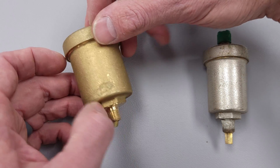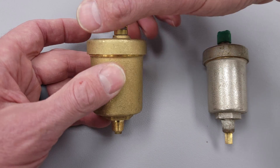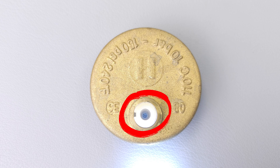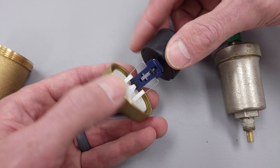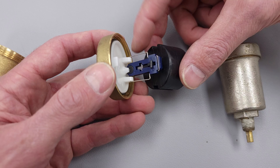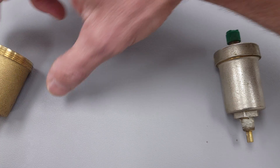In this serviceable version, you can open it up to get to the inside, but you need valves to stop the water pressure before servicing. This one has a very similar arrangement — a float — but there is no Schrader valve on this assembly. Instead there's just a little rubber piece down in here that looks like a little funnel. Anytime this is full of water, the float comes up and closes that spot — the rubber piece against the plastic piece seals it. You can clean this out and put it right back in.